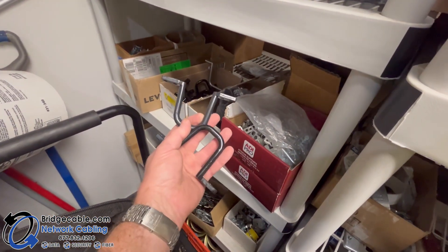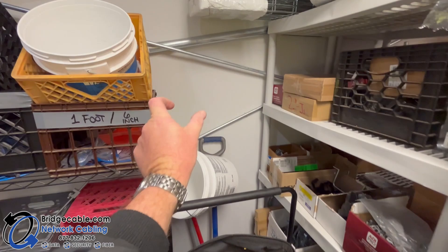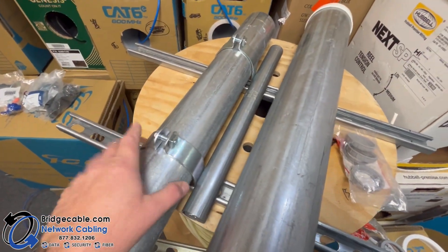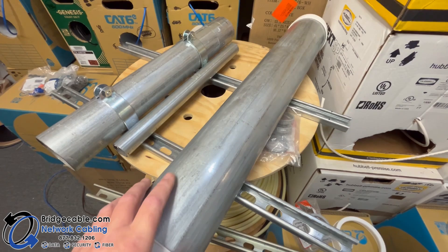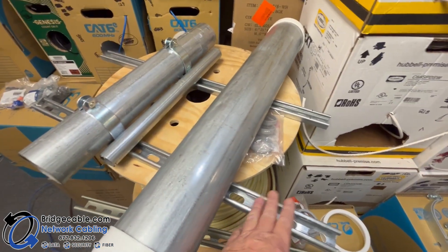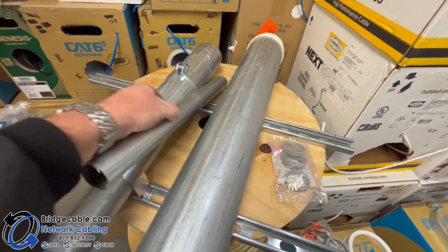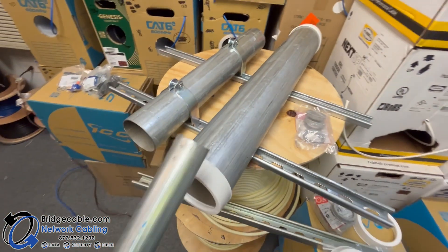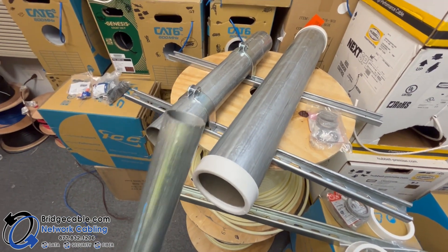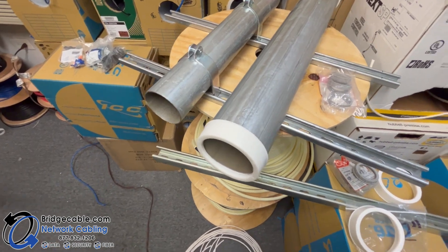You can always use an assortment of D-rings, and that will come down the ceiling very nicely. But in this video, this is a rig we're going to have in most IT rooms. We're going to have unistrut — two pieces — and depending on how many cables you have, we're going to put in a sleeve. This is a three-inch and this is a four-inch, and this is really for end locations.